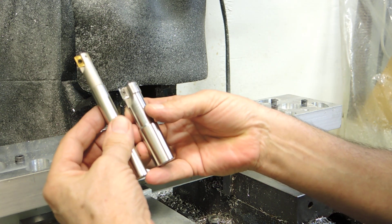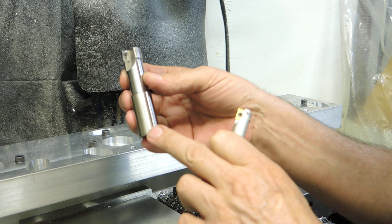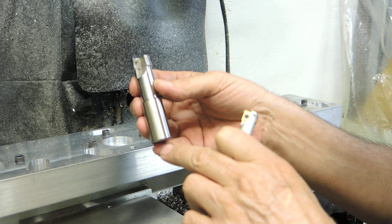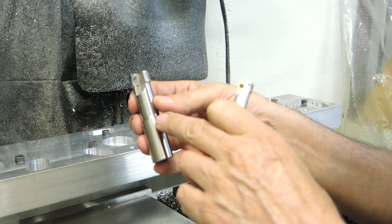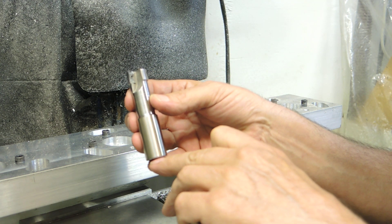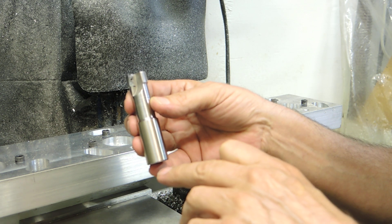They come long, and anything over 20 millimeters you have to shorten. Anything over 19 millimeters won't slide up into an R8 collet. So for these, if you don't need a long length of cut, I cut them down. They're nice hard steel, so the lathe or chop saw — the lathe seems to work pretty good on them most of the time.